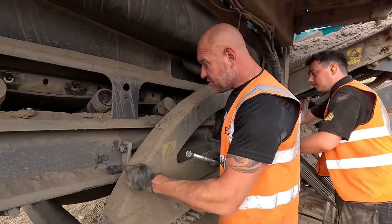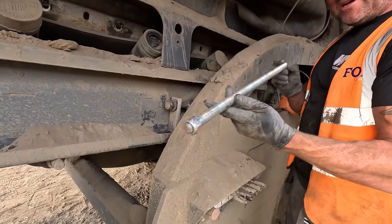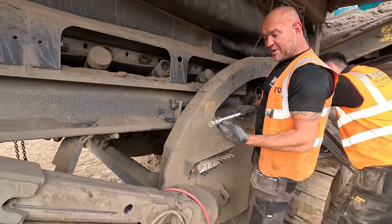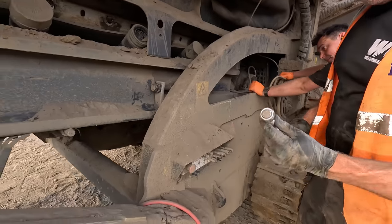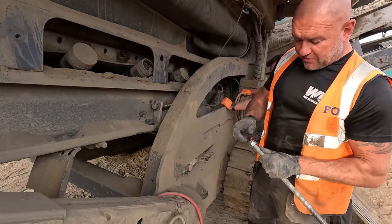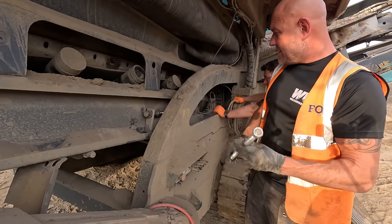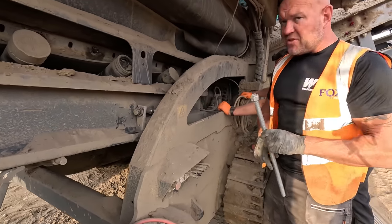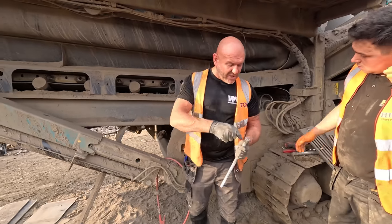We're not on ours. As you can see around the other side, it just had a bolt in for the tensioner, yeah? So we've just got a bit of 20 mil bar here, really. It should be 22 or 24, that. 24 mil bar, but we ain't got any, so 20 mil will do. If we take that nut off and weld a nut to the end, to make a big bolt basically, we'll use that for the tension on the other side. So, Cal, put a normal nut in that, and put a little bit of weld round the top, yeah?